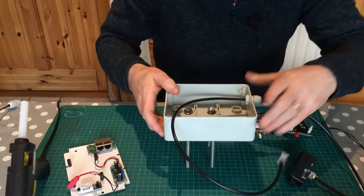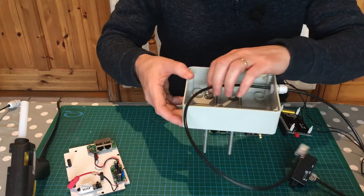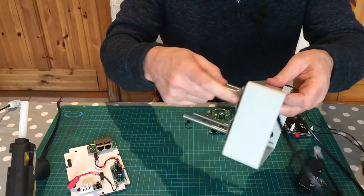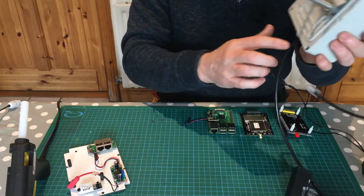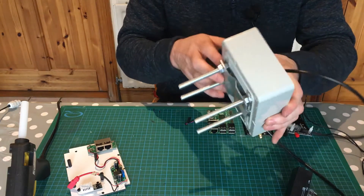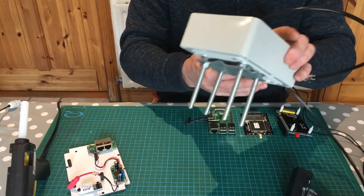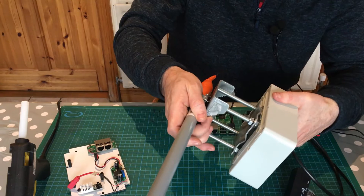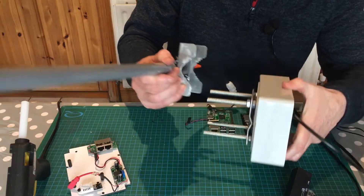The box is what we're going to push the Raspberry Pi and everything into. I have a couple of four bolts where I cut a rubber grommet and tightened it onto the back of the board so that it's waterproof. I'm going to have a bleed hole at the bottom for any water, so moisture that gathers will come down and out through the bleed hole. Those four bolts are waterproofed and onto a bracket that will attach and clamp onto a pole.